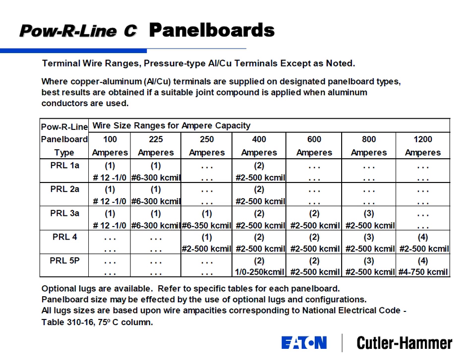Why is that? Because 90 degrees C wire is rated to go 15 degrees higher in heat than the 75 degrees, so it'll get hotter. If the wire gets hotter, the lug or the termination gets hotter. If the lug and the termination get hotter, the air in the equipment, the assembly, switchboard or panel board is going to get hotter. Therefore, that whole thing has to get retested by UL, and no manufacturers have tested for multiple ampacities with UL.